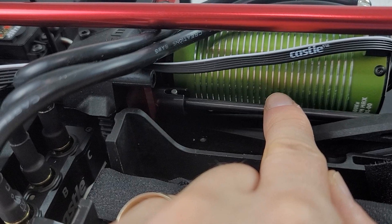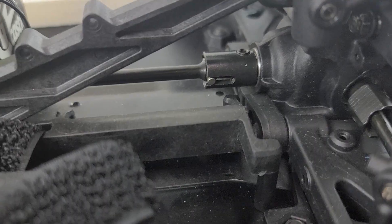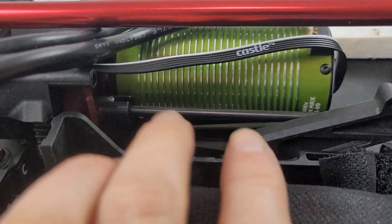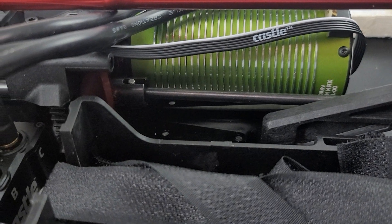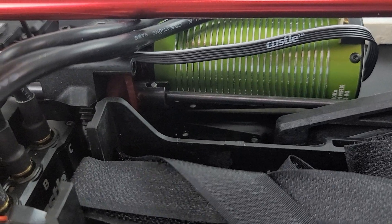However, this here is a little excessive and it does concern me because it gets somewhat close to the very end of the pocket with this drive dog coupler. So what I am looking for is a solution — if you guys have anything as to what you've done here, something simple that can fix this. What I plan to do is put a spring on this side, which would push the shaft all the way to the other side of its range, and then if I put the same spring on this side it should hold it approximately center and in a more acceptable position. Let me know what you think — is this a concern, and would this solution be sufficient?